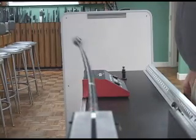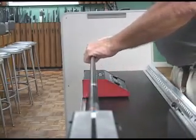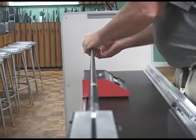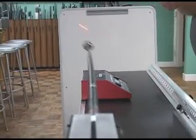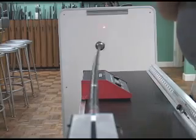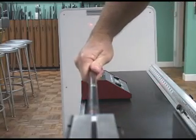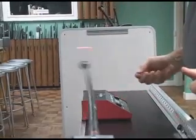You can see how bad that shaft oscillates out of plane. Now I'm going to put the laser beam on there to make it easier for you to see. You want your shaft going in a circle like that? I don't think so. Now I'm going to take and turn it like I did the other one — pull it back, let it go. It does very good going in that direction.